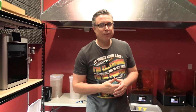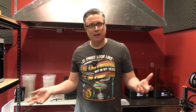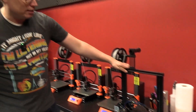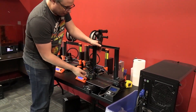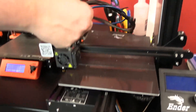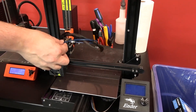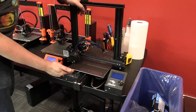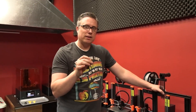So we have both of those running right now. If you're just looking to get into the hobby, learn the ins and outs, and don't want to spend a lot of money yet, down here we have our Creality Ender 3s — though I'm no longer using them. The Ender 3 is a cheap printer with cheap parts, which means you're going to learn how to replace everything from the hot end to the fans to even the tube. I've had four of these and two of them right out of the box I had to replace the tube because it would melt too easily from the heat. But the huge advantage of the Ender 3 is that you get to learn every little part of the printer.